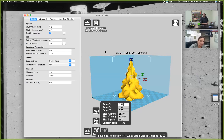On the SD card, you'll see the STL files, and we also already sliced them as test prints, as G-codes. So you can select the G-codes that are already on there in the test prints folder. Oh, there's the test. So these are G-codes. The STL files that were converted. Yes, so they're already converted for the printer, because the printer won't be able to see the STL files. They have to see those. So we give you a couple of test ones, because sometimes Cura might have different issues, and it helps to have something already ready on the printer to be able to test them.